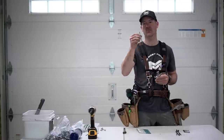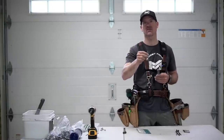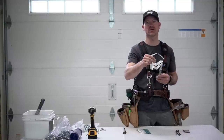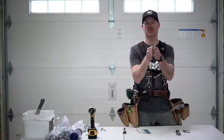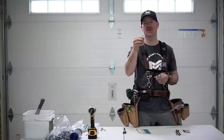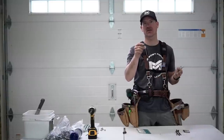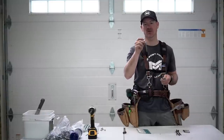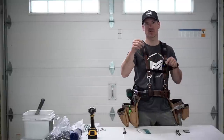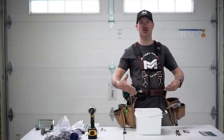One thing I keep in mind when nailing into the column: I want to make sure I'm nailing into the center of one of the two-by-six plies, versus where they're laminated together at an intersection. It'll be fine either way, but getting into the middle of a ply feels like a better connection. I'll do them at an angle — one in the middle, one in each corner.